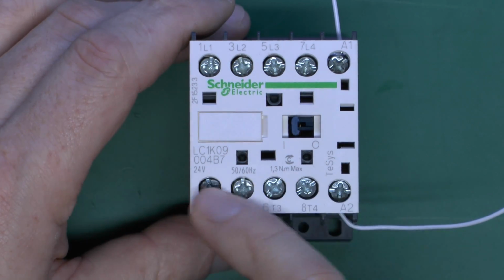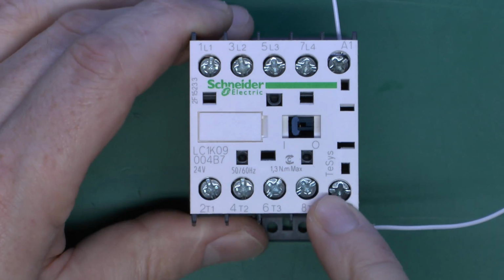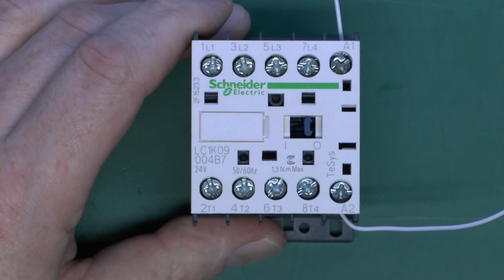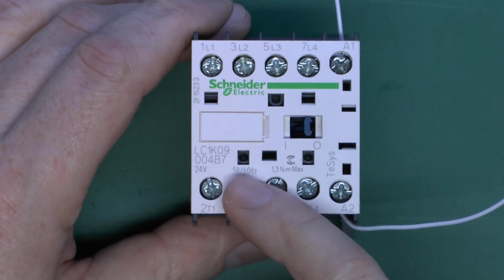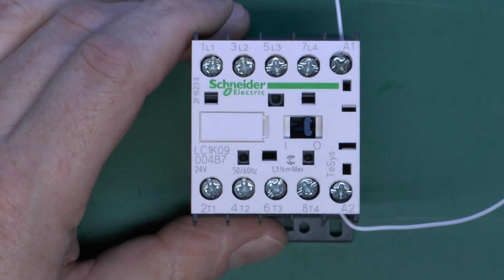And at the moment, when this is powered, it's drawing about 1.2 amps from the 24-volt DC supply, which of course is a rather considerable amount. So it is important to get the correct DC or AC version. As I say, although an AC one will usually work on DC, you'll find that the current it uses is excessive. So that's a look there at relays and contactors.